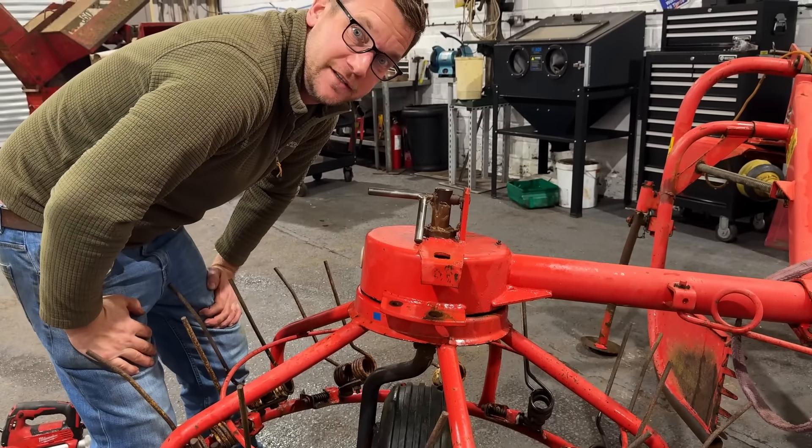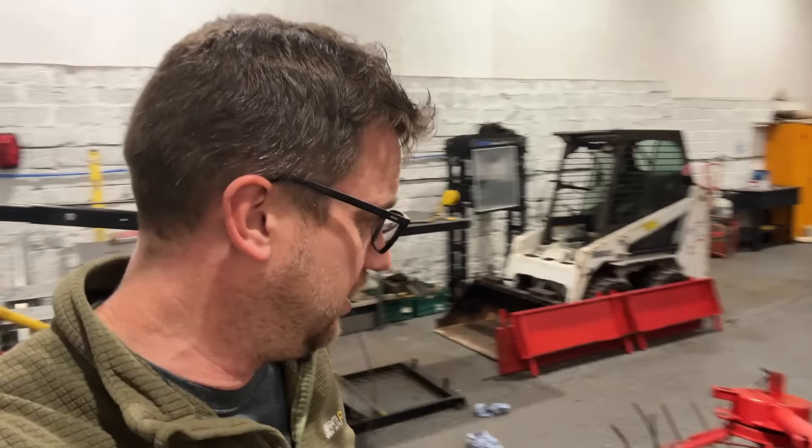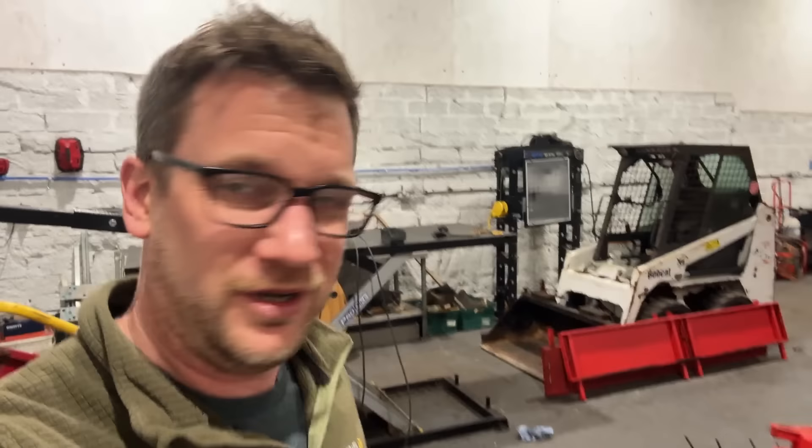I've put some oil on and they should move across. Look at that - that's what it should do! That setting is tedding, that one is rowing up - I'd have to check the manual to confirm, but I think that's right. Pull them out, twist them around, and we can grease all of these. We've gone all the way around and greased up all of the springs. Some people might say you don't want grease on Hay Bob springs because hay dust will stick to them - but if you don't grease them they seize up. It's a bit of a catch-22.